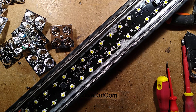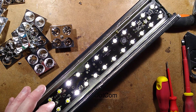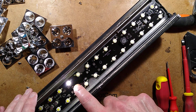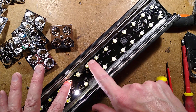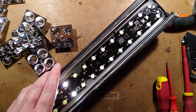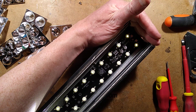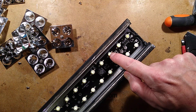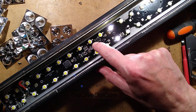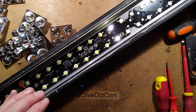It's not at full power so it's not too dazzling — just 9 volts. If I turn the voltage down you can immediately spot part of the circuitry. These two LEDs are the only two lit — they just happen to be next to two resistors in parallel. The LEDs are in series circuits of threes, but these ones are just two to pack up the number, with resistors to balance that. There's one that is flickering on and off. The other panel lights when it's in the mood but spends most of its time not lit.